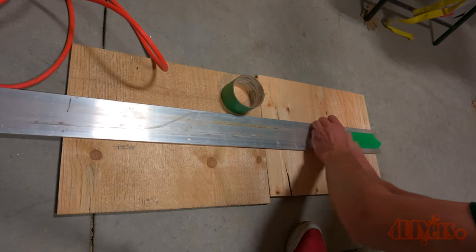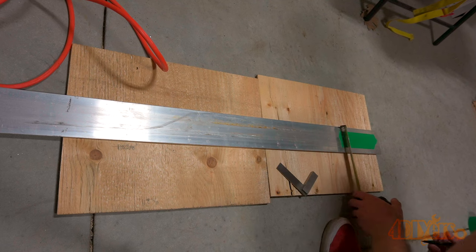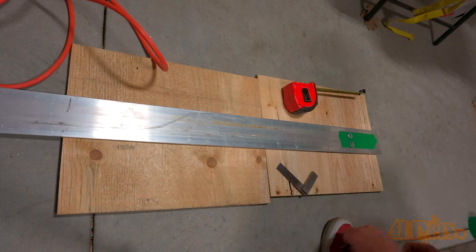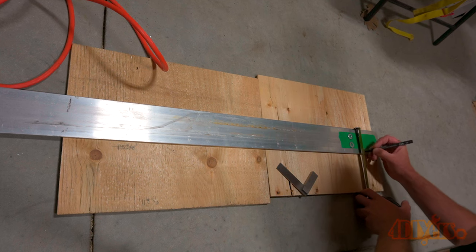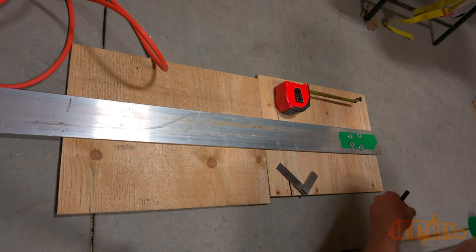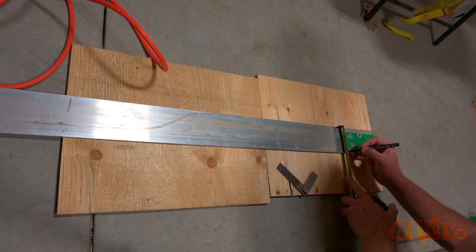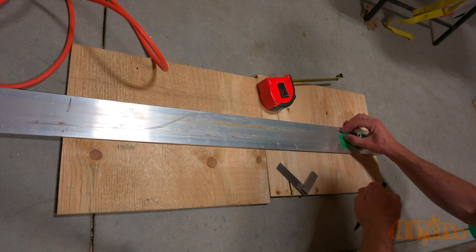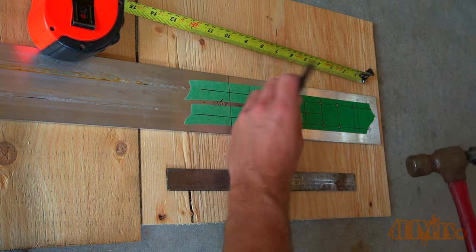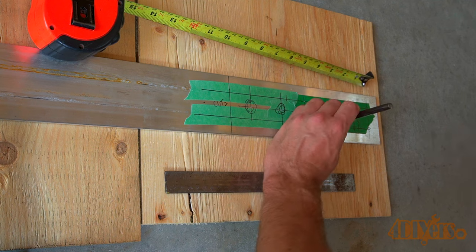I made a fully custom switch panel out of 3/16" thick aluminum. The width and height vary depending on the style and options you're adding. Being that the boat is older and before USB charging ports, I installed a USB charging port and a 12V auxiliary port. Tape was used to make an easy layout. Washers work great if you can match them up with the size of your switch diameter. Make sure you have enough room behind the panel when everything is fastened in place and wired up.